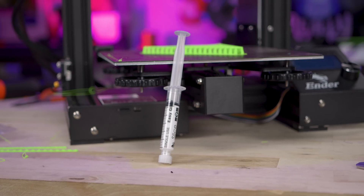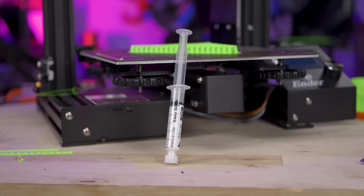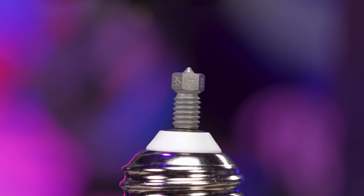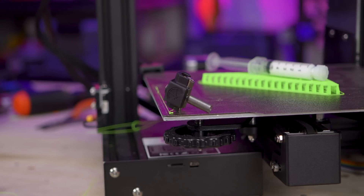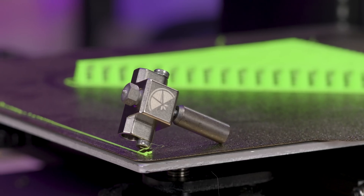In the kit you get a lot more thermal paste than you'll need just for this install, which is excellent because I use this boron nitride paste from Slice on every project I work on. You also get a 0.4 millimeter BridgeMaster wear resistant carbide coated copper nozzle. But the heart of this is the Copperhead copper heater block and the bimetallic heat break that comes in this kit.